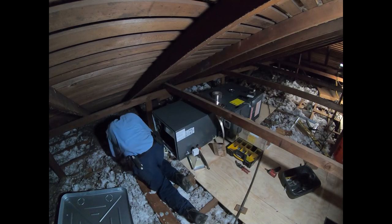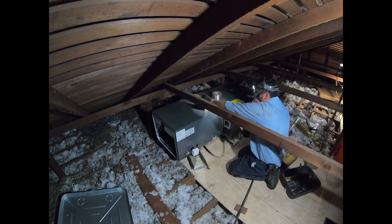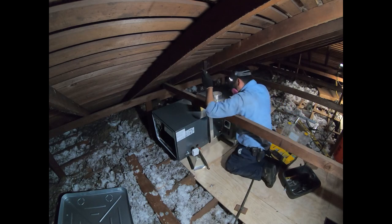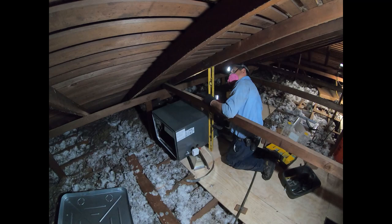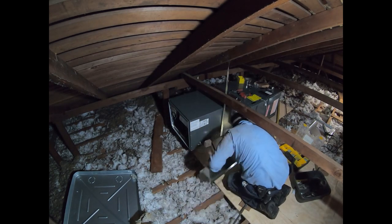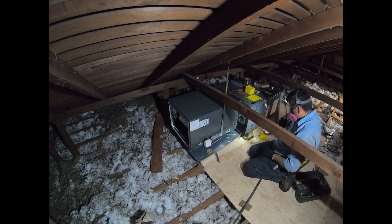The way I like to strap it is like a swing — I wrap the strap underneath and up and over so it grabs the entire coil from underneath without having to screw into the coil itself. I use a level so the strap looks plumb. Now that the evaporator coil is strapped, I can remove the furnace tent and slide the drain pan underneath.